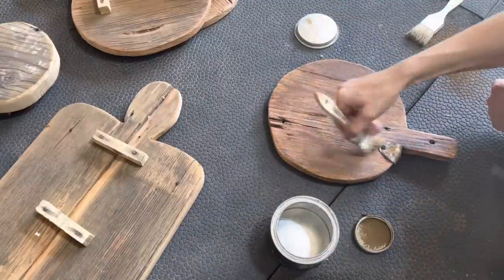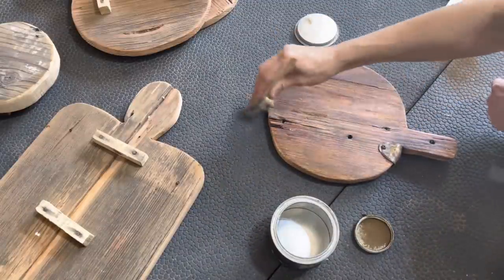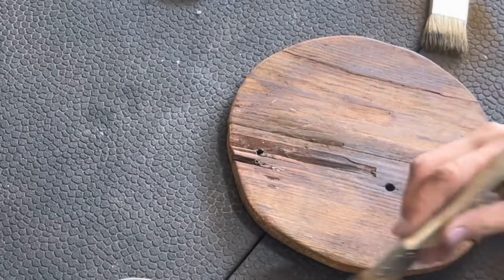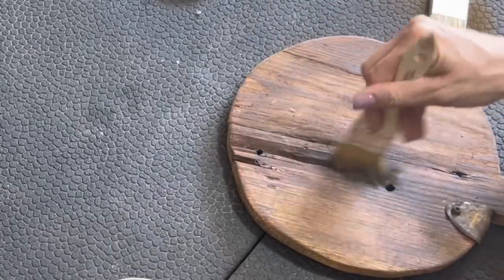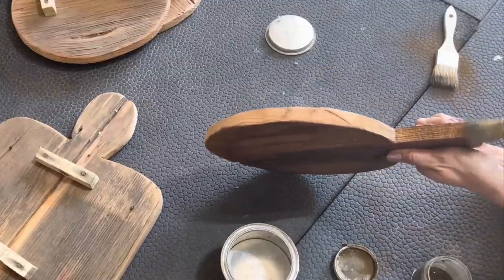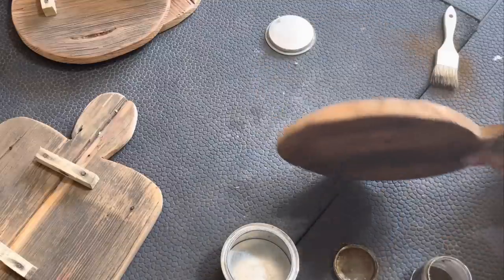It's okay. And since I have a little bit of wax on the piece, that decrepit dust is going to stick in all of the areas I have the wax. I'm highlighting where there's nicks and dings and deep cuts because that's where oil and food and grease would have gotten naturally stuck in these old antique breadboards. Then I go around the edges and you can see it just really antiques them well.